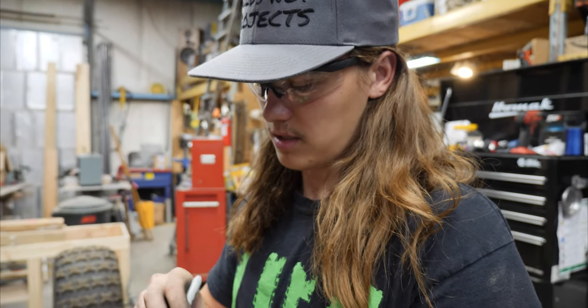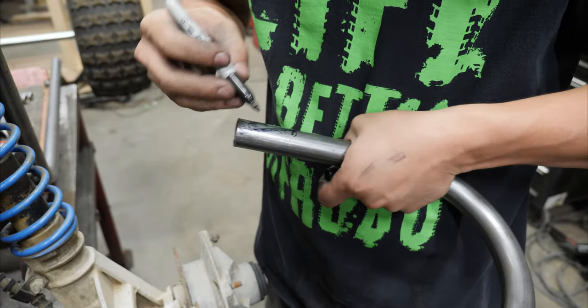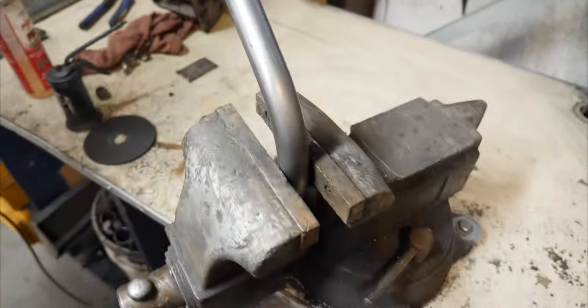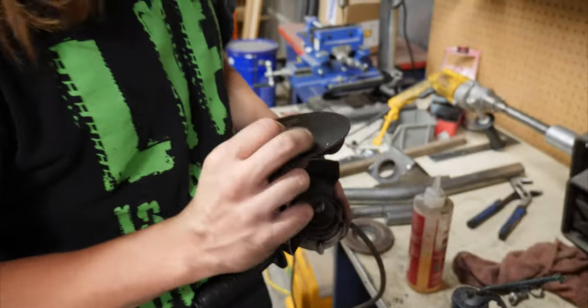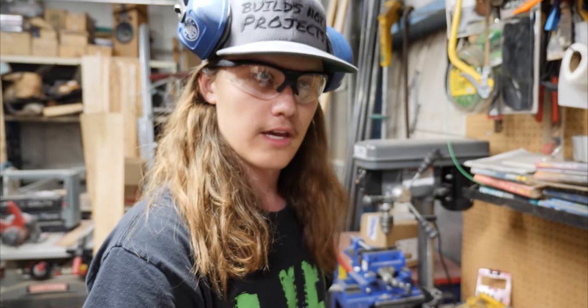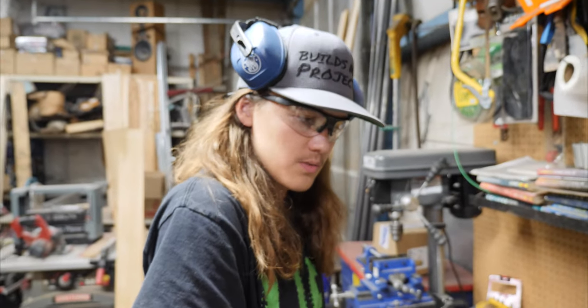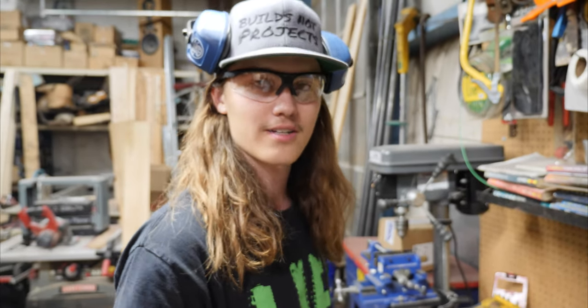How's the tube going? It's going to be interesting. Definitely don't like doing ones like this, but we'll see what happens. It's a nice piece of artwork you got on here, and I see you didn't use a notcher, so I'm assuming this is a certified grinder moment. Yep, certified grinder notching going on here. Everything I've built so far I end up with some weird janky notches like this that I have to do with the grinder, and these ones aren't very fun. I usually end up screwing them up — either fill them with weld, or I get one side correct and then screw up the other side and fill it with weld. You do what you gotta do.